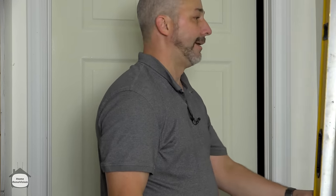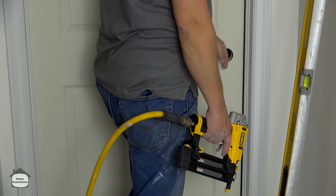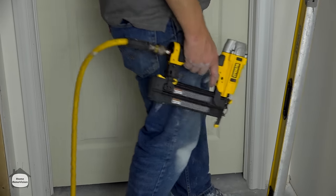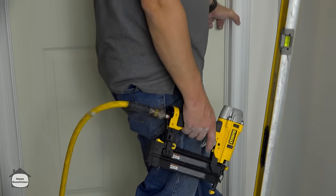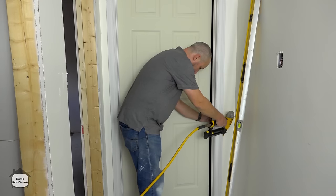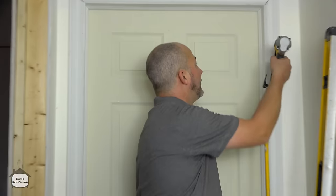So now, I'm in the same place. I have lots of flexibility here. Okay, up, down, moving around. I'm just checking my gap across the top. I'm good with that. I can close the door, I don't see any light. So I get this nice and square, and then I can just manipulate everything here until it all closes nice, and I'm not getting any rubbing. I'm gonna pull this shut a little bit here. There, that's a nice gap all the way around.